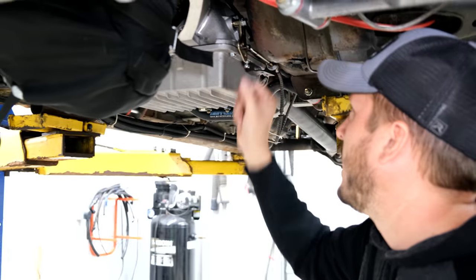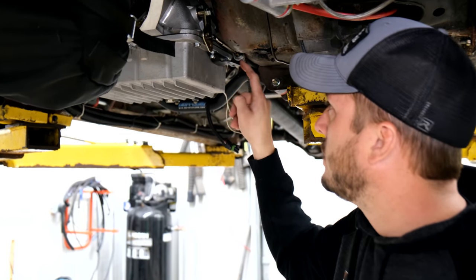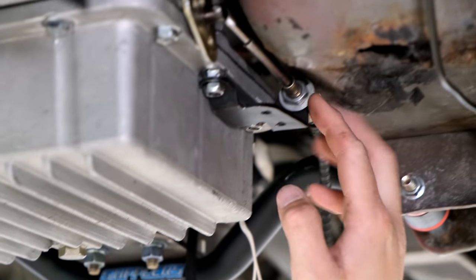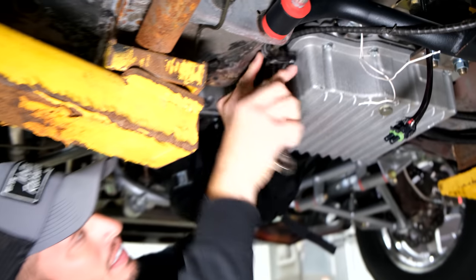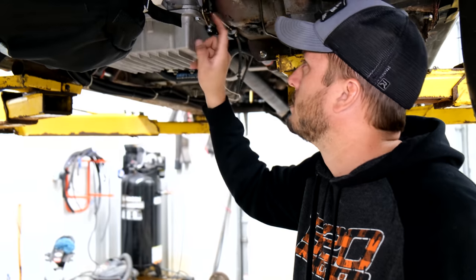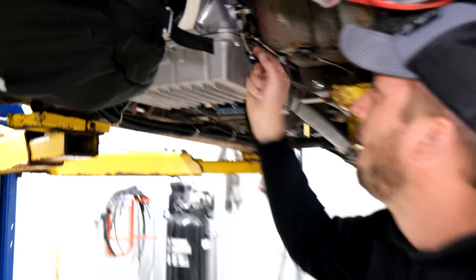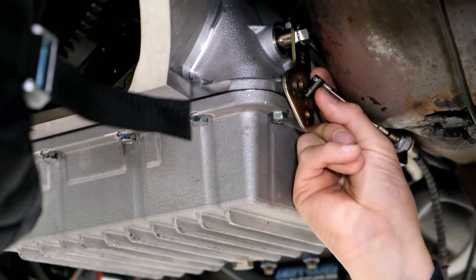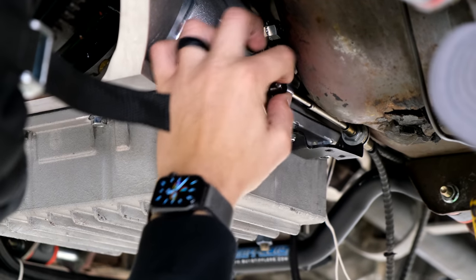You obviously just need to change the depth of that. If you need to make a wholesale change, you can actually change the two lock nuts right here that set the depth of the overall cable. That would be basically the first thing you do, and then you make small adjustments with the end fitting because it's a smaller thread pattern. Go to neutral, John — it goes in and out of neutral real smoothly.